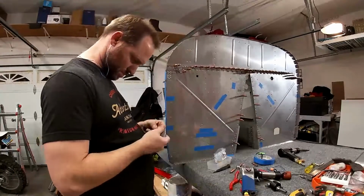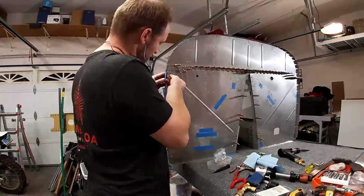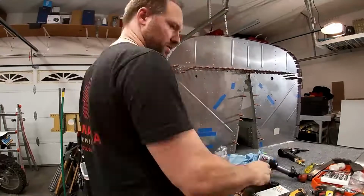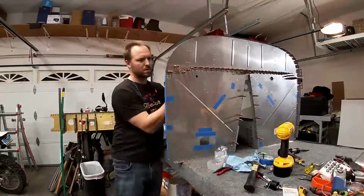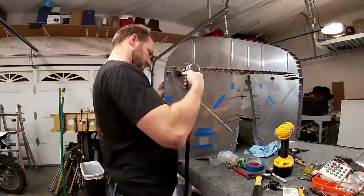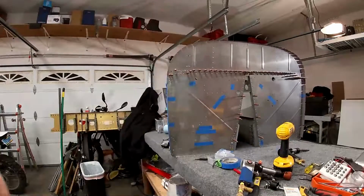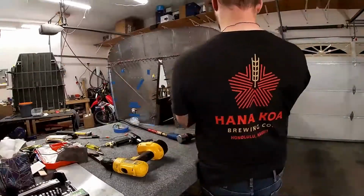So one of these I tried to rivet with the squeezer, which was fine. And that's about as far as you can go, is one. You also need to be careful here, because it looks like you should rivet all of them. And no, you should only rivet 5 of the lower rivets, and not the other 2 rivets, just the 5 lowers. And then I screwed one up and drilled it out, and everything's okay. Again, my favorite rivet set is this flush mount mushroom shroud. I forget what this thing's called. If you look in previous videos, I put a link.